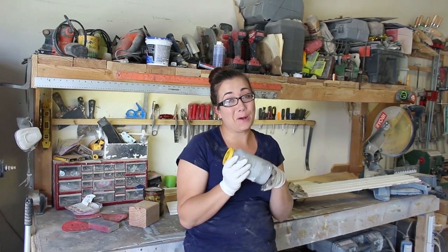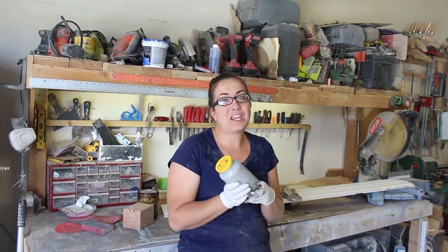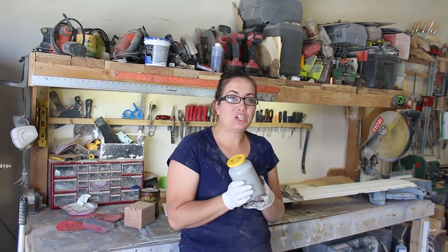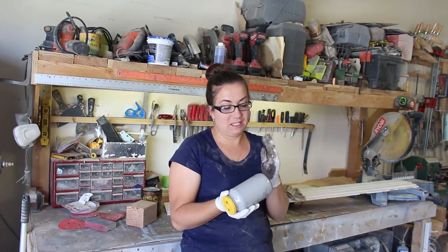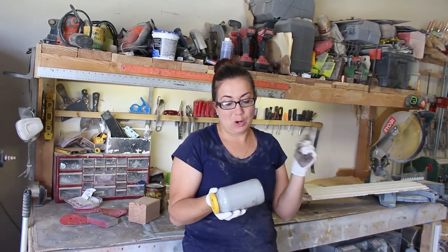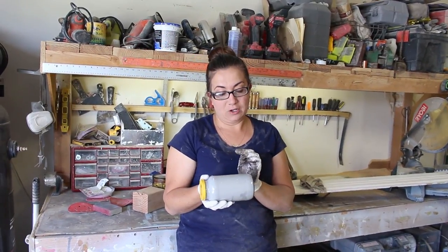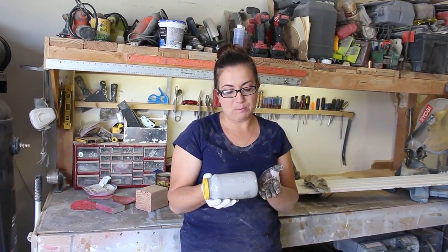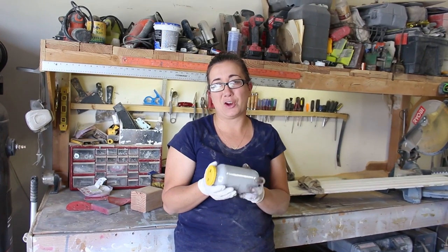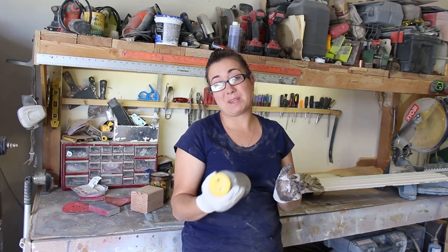So I like to save all my old spaghetti jars, my pickle jars, any kind of jars that I have. And then I use them for things like making gray washes or mixing up milk paint, and it's the perfect receptacle, and I'm not wasting something. So I've got one part chalk paint to 10 parts water. I actually mixed up arsenic and parchment because I didn't have a light gray, and so I wanted to make it a little lighter. And then I'm just gonna shake it up till it's all mixed up evenly,